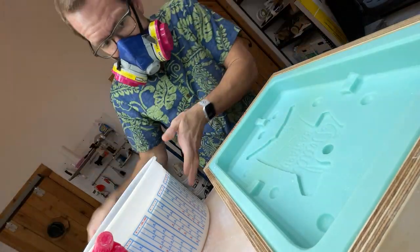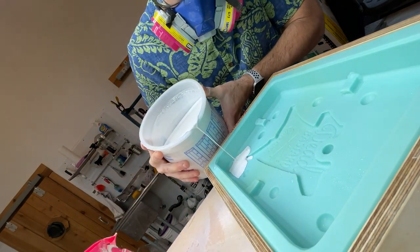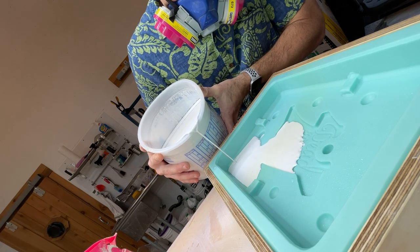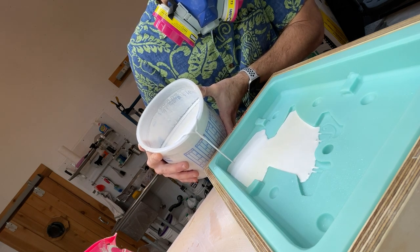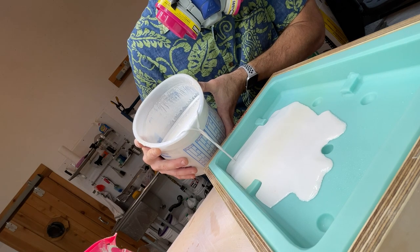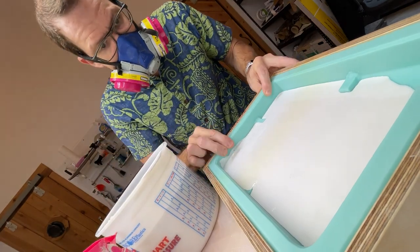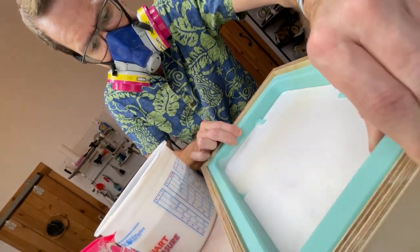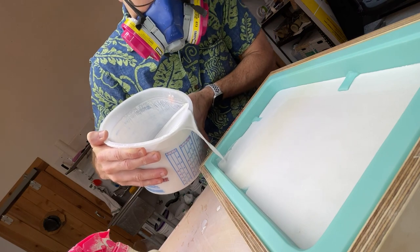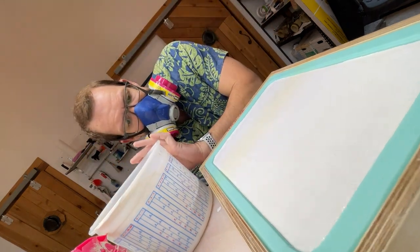The Windex — the surface tension breaker. I'm going to knock some air bubbles out, quick spritz of alcohol to break all the surface bubbles, and then we're going. I put this stuff in very slowly, and I want the actual surface tension of the plaster to pull it across the mold surface. I don't want to push it in and encapsulate any bubbles. You're watching this at like two times speed and still it's slow — this is my magical bubble breaking technique. Once I've got that surface de-bubbled and poured, I can speed up the pour.